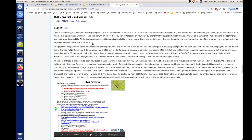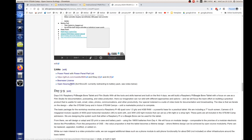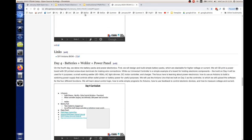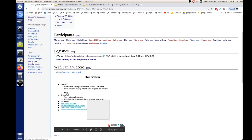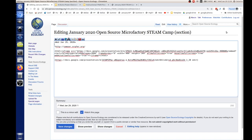So the end voltage would need to be more than 36 volts? No, more than 24. 36 is what I used, and that worked. Actually at 36 volts it ended up pretty hot. It was a very hot arc, with spatter, but one redeeming thing is that with a 1/16 inch rod, I was able to poke a hole directly through a quarter inch plate metal. Wow, that's more like cutting. Yeah, plasma arc. Okay, so let's do it.